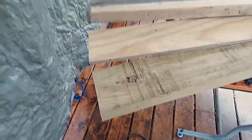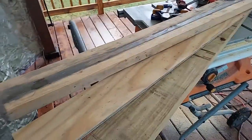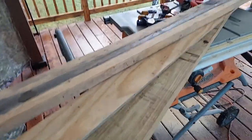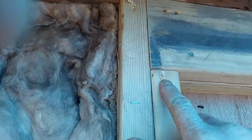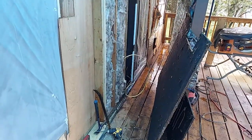These are the components of our header. We're going to get them all lined up, use some bar clamps, get them clamped together, and then get some construction screws in them. The header is installed — toenails are screwed in right here, and then multiple screws up through to the top plate. We've got the insulation in and we are ready to get the builder board back installed. There's a wire sticking out for a new outlet we're going to add, and we're ready to get some builder board cut and get it on.